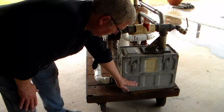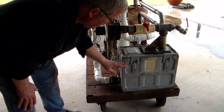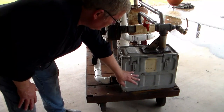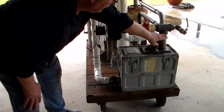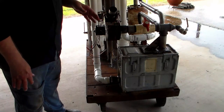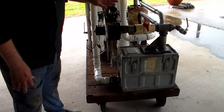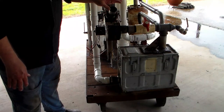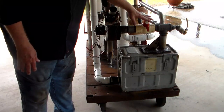I'm going to put a little shelf in here with expanded metal on top, and then put about an eight inch layer of straw or hay in here for my final filter. The gas is going to come out here, and this is the motor that actually draws it through to get the gas generation going. Once it's been operating for about 10 to 15 minutes, the gas should be in good shape, then I can cut my blower valve off.